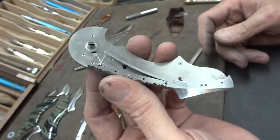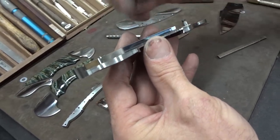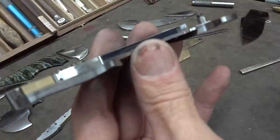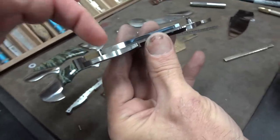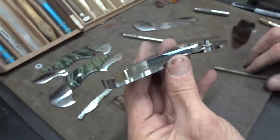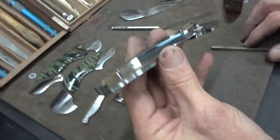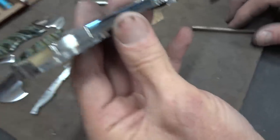So here is the one I was assembling — we've got our washer in place, you can see the spring is attached. Since I've hidden the screws and the button, I want to kind of hide the way the spring sits, so I mill a pocket for the spring to set into. So when you look at the knife this way, there's no pin or anything holding that spring in — it doesn't look like there's really a spring in there. When the knife is together and you're looking inside with the blade open, you can't see this spring — it looks like you're looking at the underside of the backspacer. Right now you see this blue color — that's the temper color. When it's all finished, it's all going to be the same color, so everything blends in and hides. So you've hidden your release button, you've hidden your spring. Nobody can tell this is an automatic, because you're going to put a thumb stud in the blade — it's going to look like any normal, everyday manual folding knife. But it's an auto. You would have to tear down the knife to even see the spring that's in here.